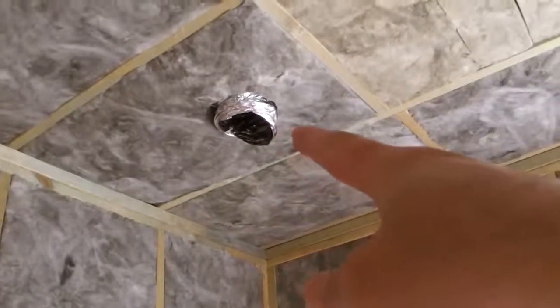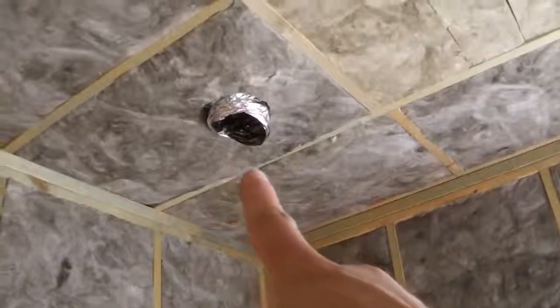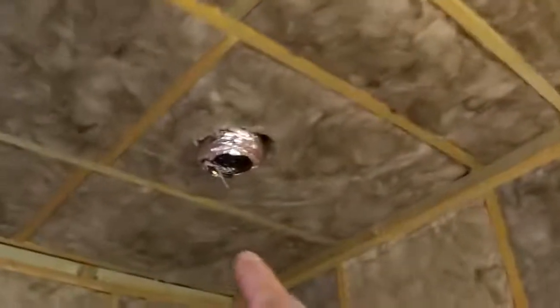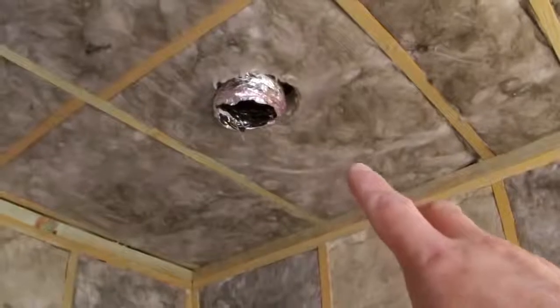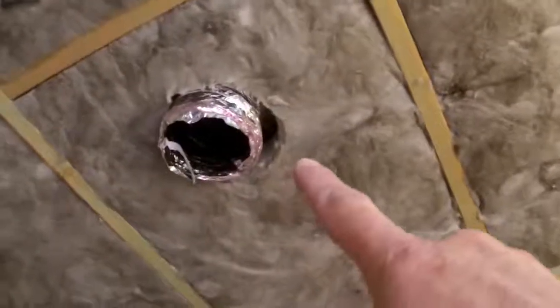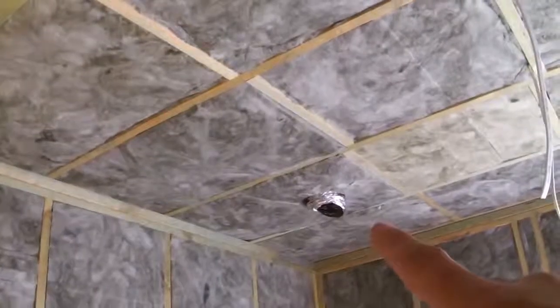That's the vent for the outgoing. That's where the air is going to be sucked in from that exhaust vent that you just saw earlier, and the intake is further in. So this is where the fresh air will be coming from. This is more on the inside, because this is where my desk will be on this side of the wall. So I thought, you know, coming fresh air right where I'm normally sitting is a better option. So I thought I'll mention that and show you how it's all cut and coming through from the ceiling, and that's the exhaust air going out.